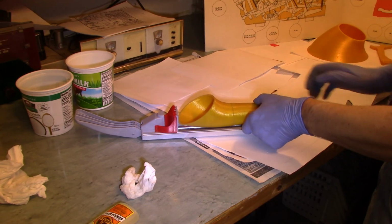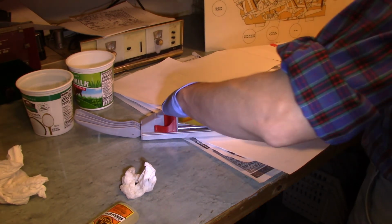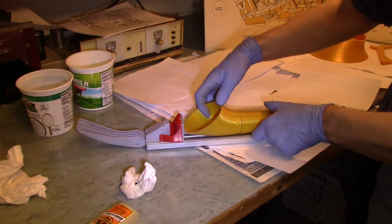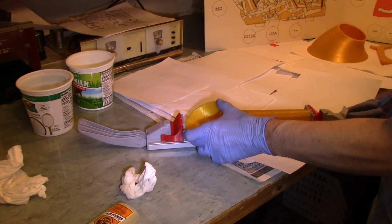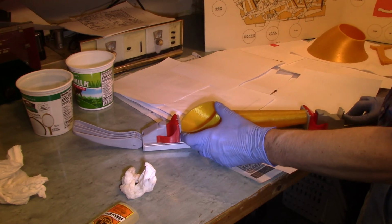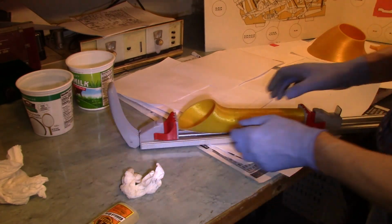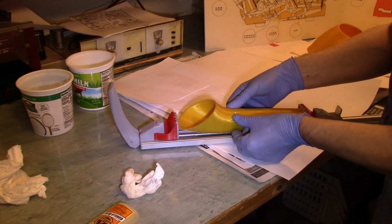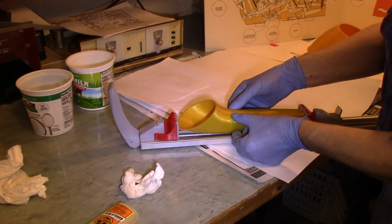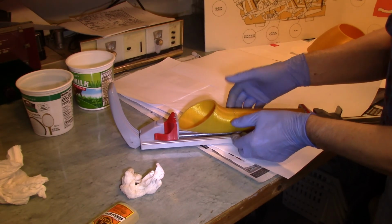And luckily this conical section right at this point is indeed a simple symmetrical conical section, so it's not really a problem as far as getting your axial alignment with the conical section. So now what I'm going to do is I'm going to compress it, and I'm going to look for any sort of odd bowing there, see if I can get, if it really is truly in there.